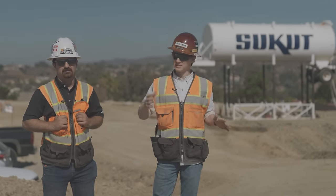That fuel tank that we cut open - this is what sits inside that houses the DPF. We make a frame like this that houses all that, and then the fuel tank is the enclosure around it. They fabricate all of this here in the shop. Because the machine's not designed to have the DPF and new engine, they have to modify the machine to accommodate everything.